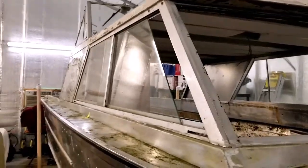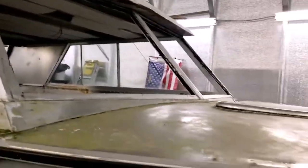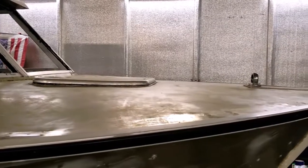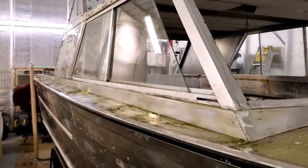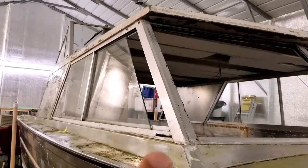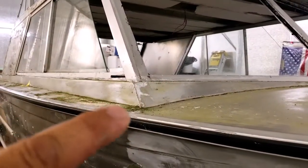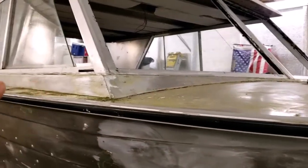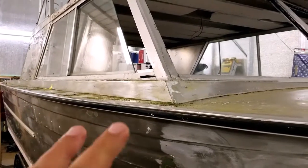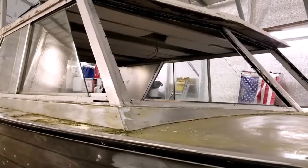What we've got to do now is DA all these surfaces, because you can still see a little green avocado tint to it. We're going to DA that with 380-grit sandpaper. DA is dual-action sander — a sander that goes in multiple directions, not just in a circle. It will knock that stuff right off and get us prepped for paint. At the same time, this product we're using is fantastic for removing all the caulk along the window seams and where the various parts of the boat meet and mate. We've got to come along all these seams again before we paint and put in a bead of 5200 sealer to make sure we seal the boat and keep the water out.